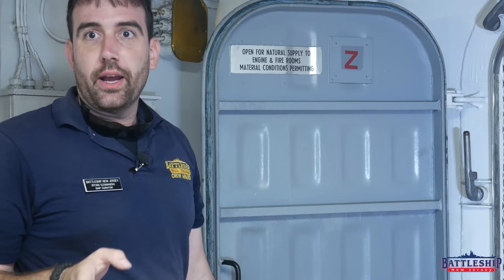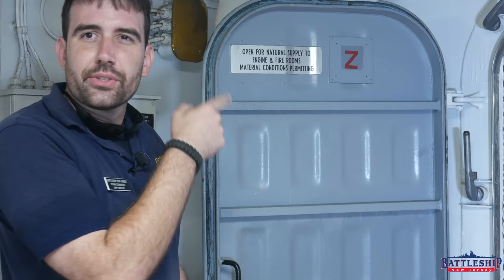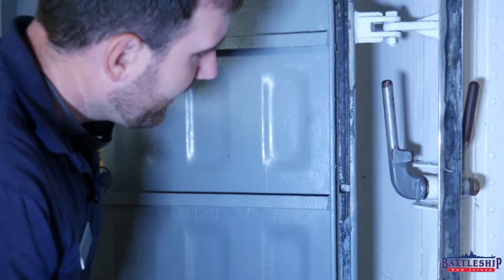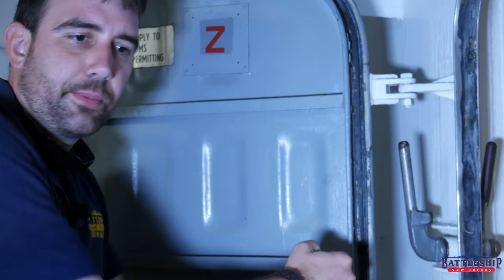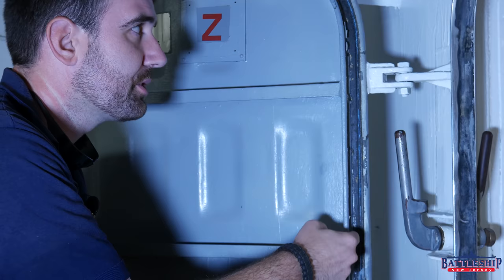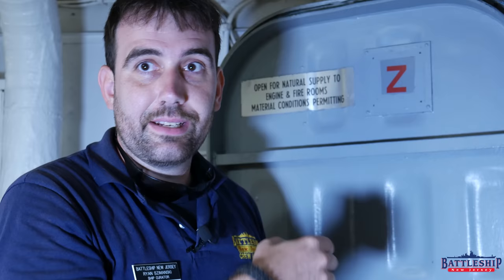These gaskets come in strips. If you're doing this right, you start your strip at the top, go all the way around, and end up back at the top with just a small gap — small enough that when the door is crushed shut, the rubber expands and fills it in. Looking at this door, it appears they were using the end of a roll, so we've actually got two gaps — that's the only part that isn't ideal. One piece of rubber ends here, and they inserted a new piece. You've got to stretch the rubber out to fit it in because of the lip it has to go under, so they weren't able to close it up perfectly and added a new piece — classic end-of-roll situation rather than pulling it all out and wasting almost a full door's worth of gasket.